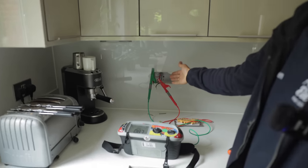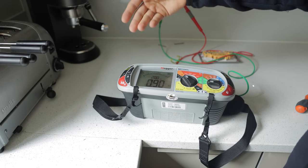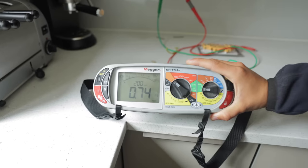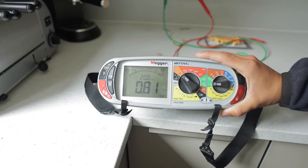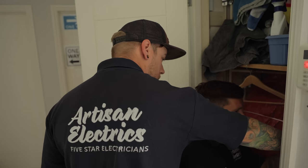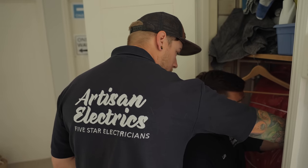We finally found a socket to do our end-to-ends on. I was testing and got 0.74 — nice low reading — then it spiked up to 1.2 and I looked over and John was wiggling a socket. If John wiggles that, you can see it jumping up and down. It's always good to check for a loose connection — that'll be the start. We want to get the end of line on the circuit.